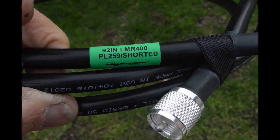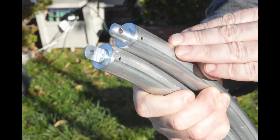So the better the conductivity of the loop itself, the better signal we're going to have radiated. Well, a fat tubular conductor within the loop element that's smooth is going to have almost no eddy currents. And you may say, oh, it's not copper, it's aluminum. Well, aluminum has a DC ohmic resistance of only 1.6 times that of copper, that is DC, but the RF skin effect of both copper and aluminum are close. In copper, the signal only gets 20 microns into the conductor, whereas in aluminum it's only a mere 26 microns.